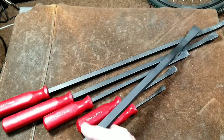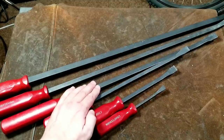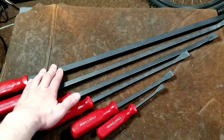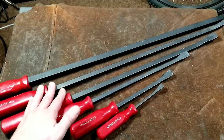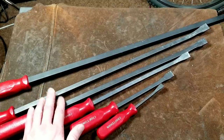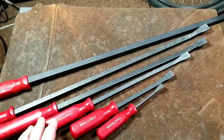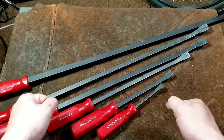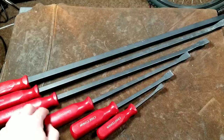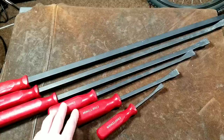If you were buying these individually, I'd do a three-piece set of the largest one, the middle 25-inch, and the 12-inch. But really the best scenario is getting the whole set, because you have big enough pry bars for the torque you need and you have two large pry bars for situations where you need to pry stuff off evenly. If you're manually prying off gears or transmission cases, instead of rocking around with one pry bar, use two — one on each side — and you can just lift it evenly like a press. That's another reason to get the whole set, along with having all the sizes you need. A lot of times you want to use the largest pry bar you can physically fit in the situation for more control.